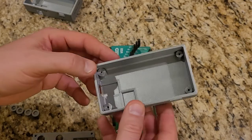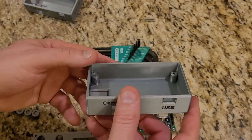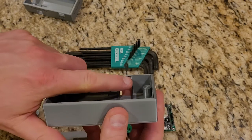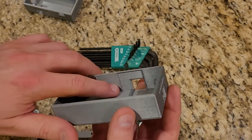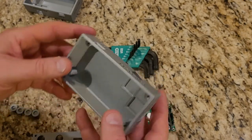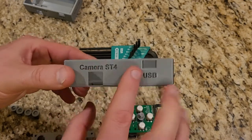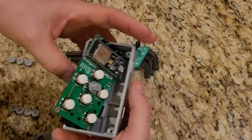Roman did a really nice job. I made a few mods to his file — I adjusted the depth of the cutouts in the bottom to match my RJ12 ports. Because I had so much trouble getting the part in, I made myself a little bit of clearance by pushing this wall back. This is my first time modifying an STL file. There's a fragment in the corner I was unable to get rid of, but it was unimportant. I also gave myself a nice big fillet around the USB port, and I really like that he has labels for each of the ports.